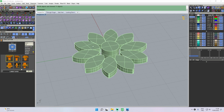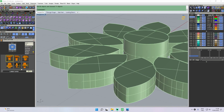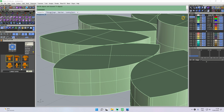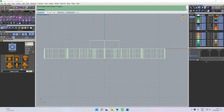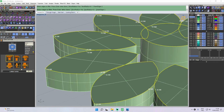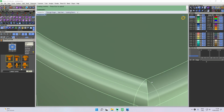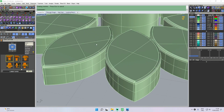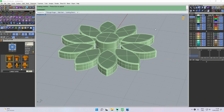Now we can actually fillet some edges to get rid of this view. You know, we can fillet the edges to make a better looking view. Let's try. I'll show you. I'll go to fillet edge and then let's type in just 01, that will be fine. And I'll choose all those edges here and this one. Basically, we chose all the top edges. Right click twice. You can see they are filleted, and now they will look better because they're smoother and they will shine better after the polishing. To bring everything back, just click show.